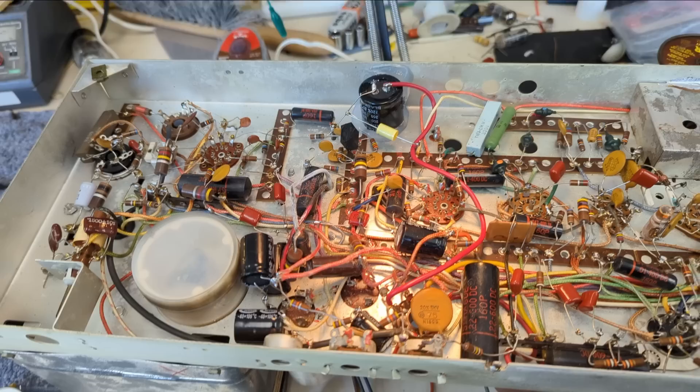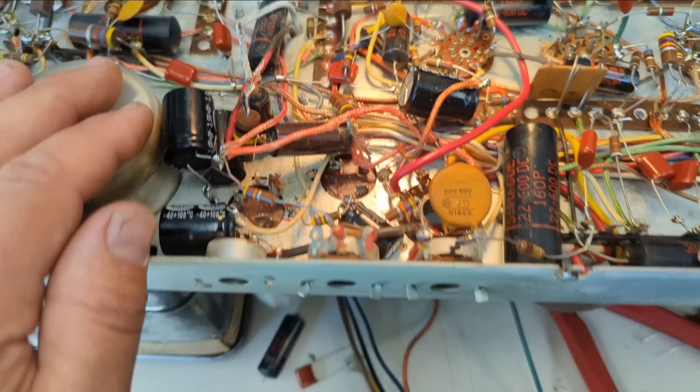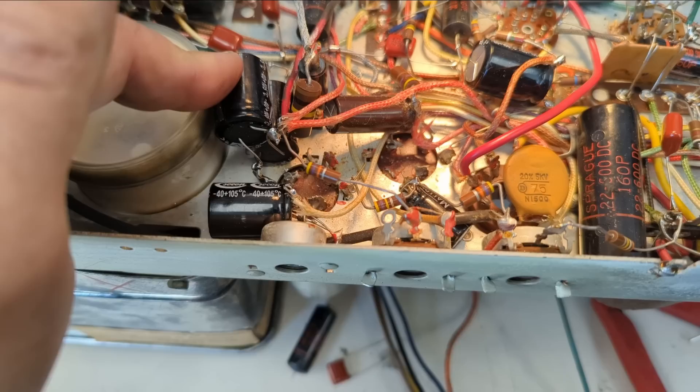Then off to the task of replacing this whole bunch of little black capacitors. I got a little ahead of myself — I get distracted at the museum — but I've gotten a fair start. All of the electrolytics are replaced. I had to put two capacitors together because one of the values was 80 microfarads, so I put two 47 microfarad caps together. You can go over the microfarad value as long as you're at or over — you're fine.